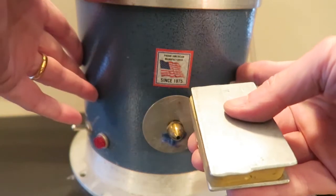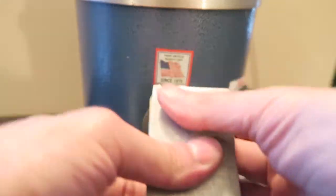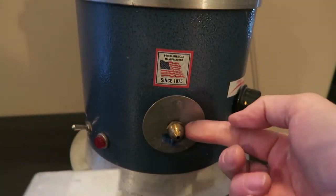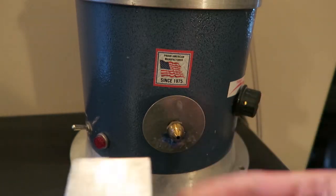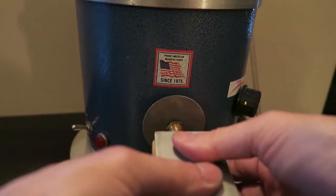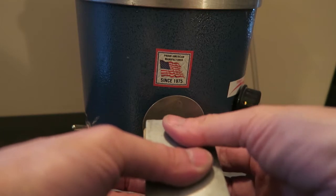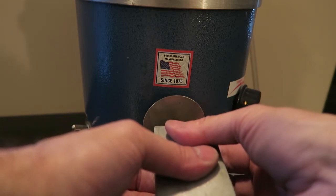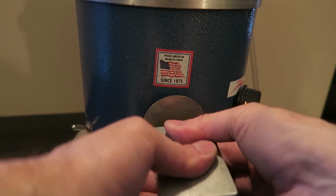We should have a bit of a compressor. I've just simply got a foot pump to give me some pressure. We push this against the nozzle. When the nozzle goes in, the wax comes out. The wax fills up my void that I've got in here. Wait for 3 seconds, make sure it cools down, and then we are fit and ready to go to open it.